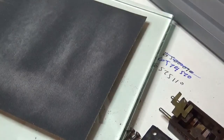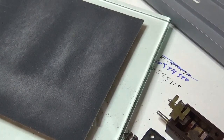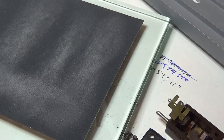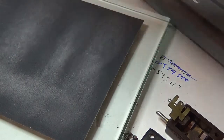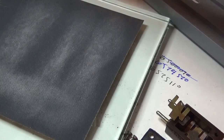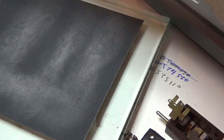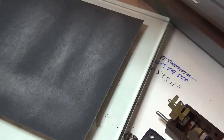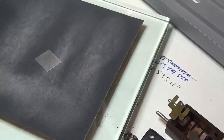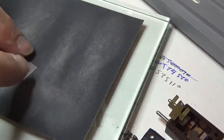So I'm going to turn over here again. I'm going to take this off. Let's say I want to go somewhere like, I'm going to try to go to 7035, exactly between 7030 and 7040. So I got a ways to go. I got another 30,000 to move it. And I just moved it 6,000 by doing 50 figure eights. So I'm going to go back down to my plate, and I'm going to do another 100.